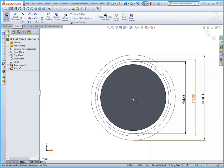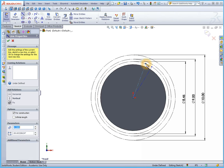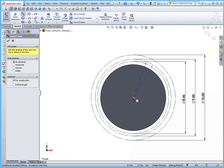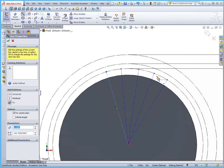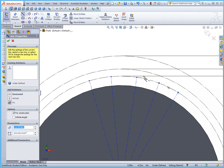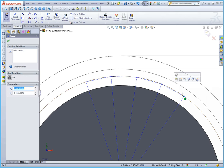So I'm going to draw one line and keep drawing lines — we probably need about four or five of these at least. One of the criteria is that these lines all have to be the same spacing apart, representing equal segments. Rather than using dimensions to fix them, it's easier to draw another segment line between these points as a straight line, and then set the length of all those lines to be equal to each other using a relation without defining the actual dimension. So if I select those individual line segments and say they're all equal to each other, now if I move one, the entire assembly will move along with it.